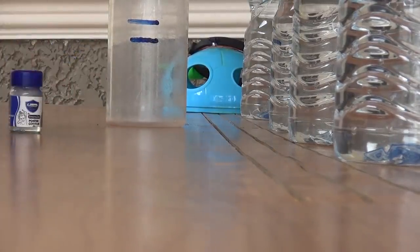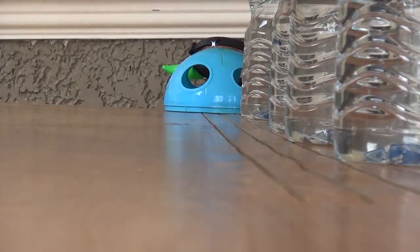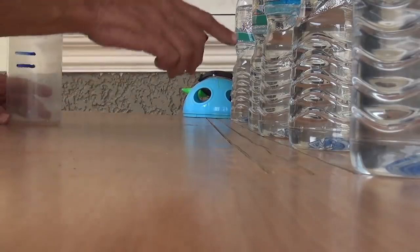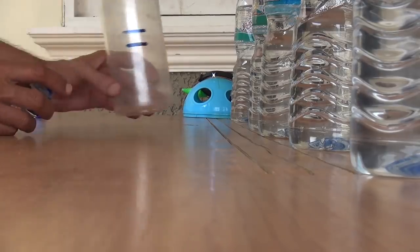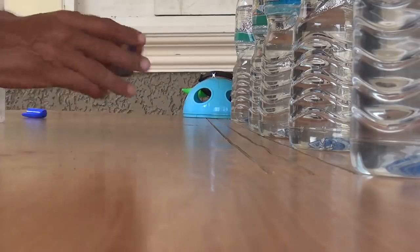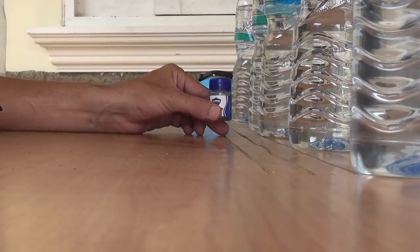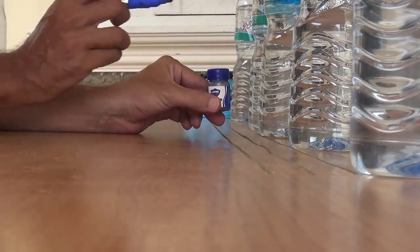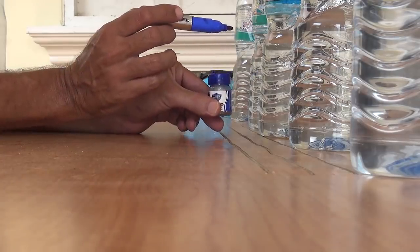Okay, right, next bottle along, remembering that there's 100 meters between each of these bottles, so just zoom out a little bit more. Okay, so we're on the third bottle now. Again, the water is level, the water's all the same level, which will naturally be. Sorry, we'll put this here now, which is our clip, and we raise up the clip until it blocks off, until it eclipses the light. So I think it's eclipsing the light now. That's about right.